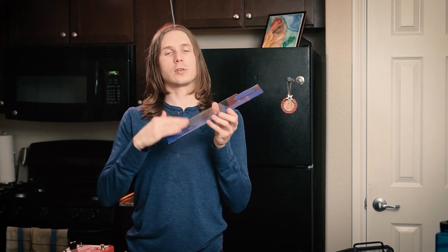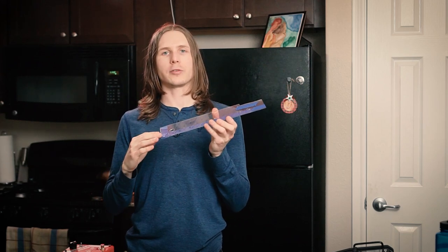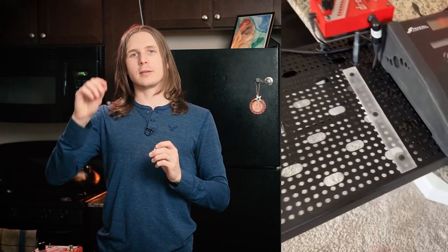But there's one last step before you screw everything together. In order for your Velcro to sit flat along the strip, you're going to need to countersink all of the screws and make sure the screws you buy are countersink screws. For that, you're going to need a countersink bit — it's just a big wide kind of bit. The size doesn't really matter as long as you don't go too deep. Just put the screw in, if it fits, great, then move on. Drill a little bit, test the fit, drill a little bit, test the fit — make sure you don't overdo it because these are pretty thin strips.